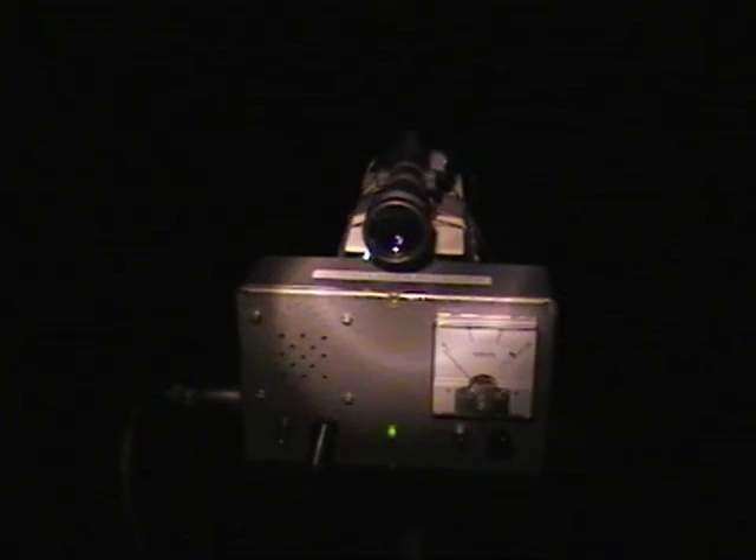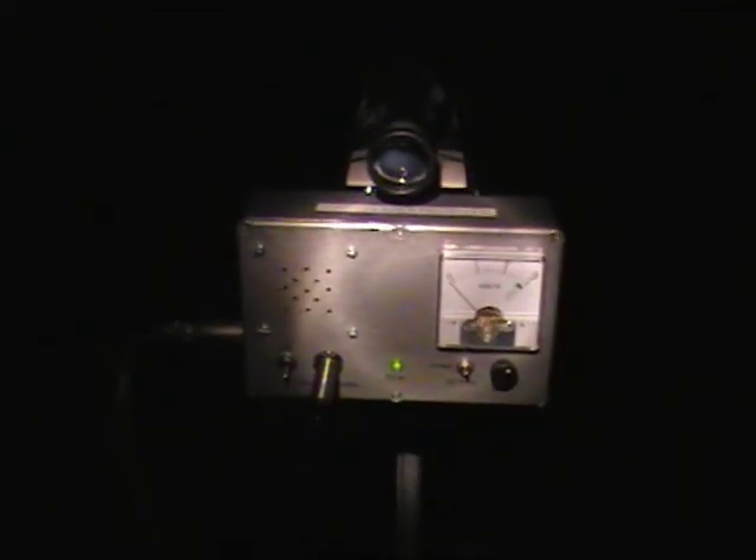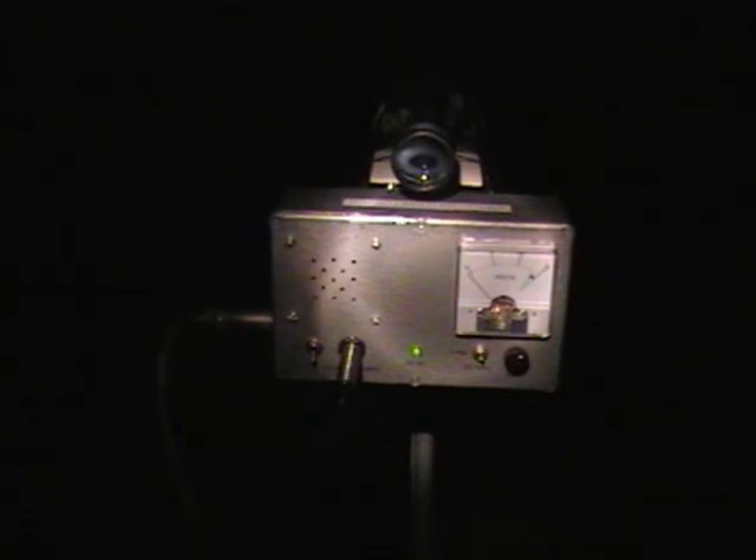G4HJW — Martin is getting snatches. The problem is his stand isn't particularly stable; it's only an ordinary camera tripod, so just touching anything makes the alignment shift. He'll give a 3x3 report as fair. On his own receiver, Bernie is seeing the red light from Martin but as yet has heard no modulation. Bernie has been running 10 watts against Martin's probably 600–700 milliwatts, so there's a considerable difference between the two signals.